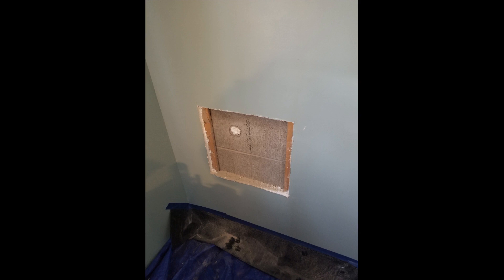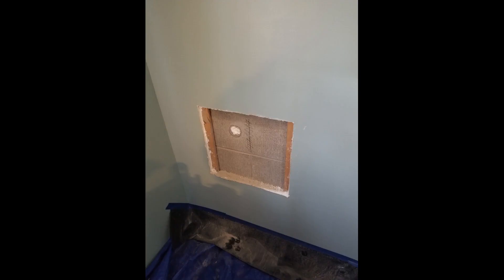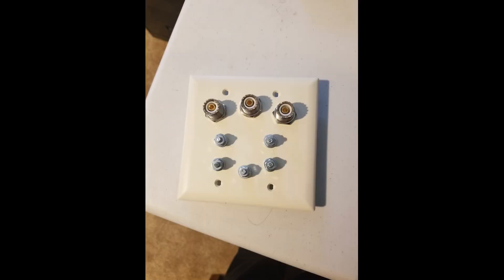Of course, I could see what he was talking about with the webbing. That black line is where the webbing of the concrete block is. So I took a string, worked it around to the window and back, to figure out where we were on the brick wall and where we would end up. We drew the hole and started drilling from the inside out. Then we drilled through the rest of the brick — figuring it was within a couple of inches — and the holes lined up halfway. You see half the hole from either side, which was perfect. Then I had to build the box for the outside, with three coax connections, two places for ladder line, and one stud for ground. I also built the inside plate with the same configuration.